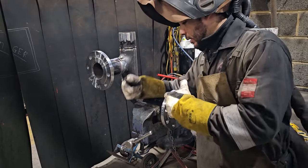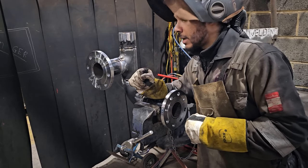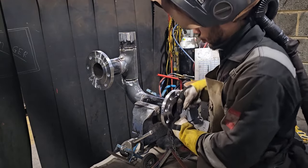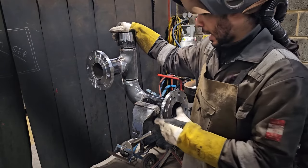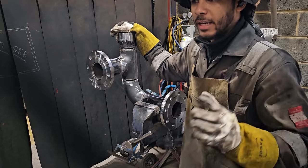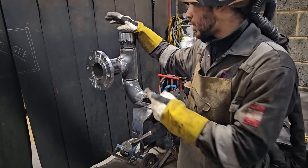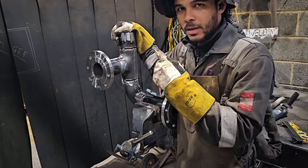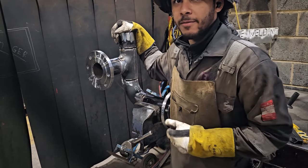I've made enough of these to know I can pull out the flanges 16mm and that's enough to get the measurements. I should use a straight edge to get the right measurements, but there's a 3mm tolerance on them and I've made enough to not worry about it. It's going to save me about 10 to 15 minutes overall making the two of these. Since starting, it's only been around 30 minutes to get to this stage.